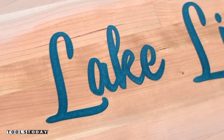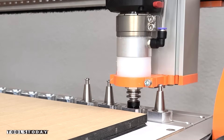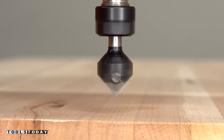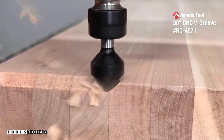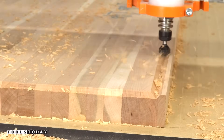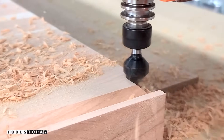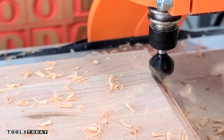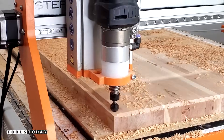After this is done, we'll put it back on the CNC and use the RC-45711 90-degree V-insert bit to go through and add a chamfer along the edge of this cutting board. It's really a nice way to do it on the CNC, and I can do this before I do the profile cut. I have this set up to do a profile cut on the line, which gives me a really nice area to chamfer, and then later I'll cut the profile right up next to it and we'll have a nice chamfer there.